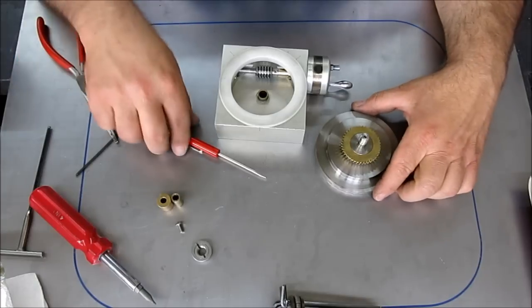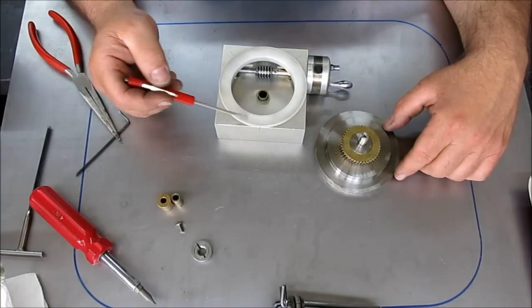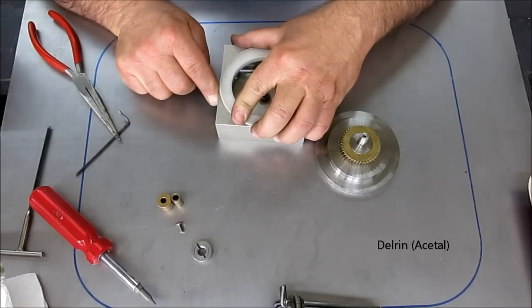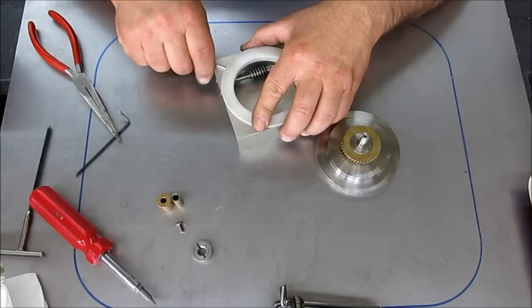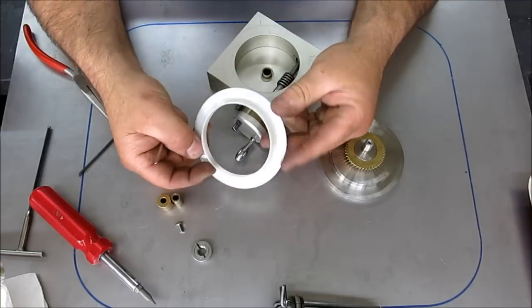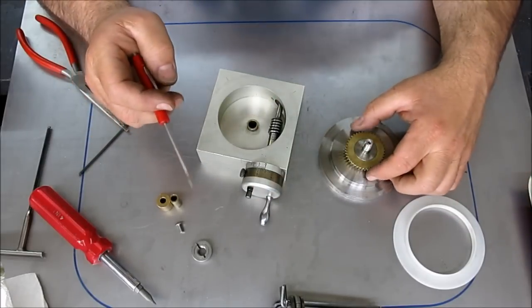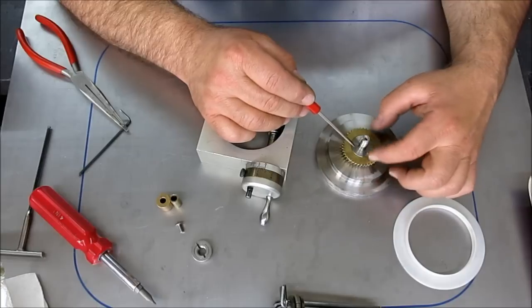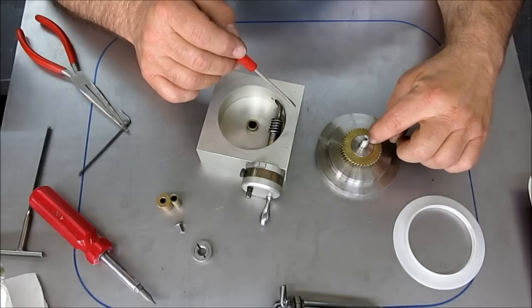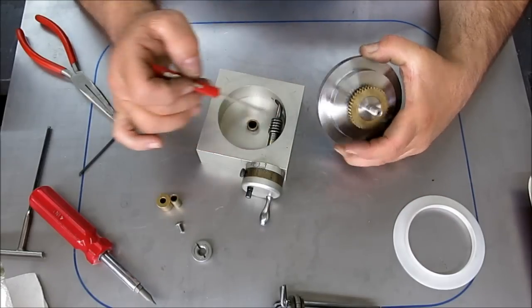We'll take a look at the inside here. There's the worm gear and there's the worm, and you can see there's a bronze bushing in the bottom there. The main table bushing is made out of Delrin here. I'll go ahead and just pop that up gently. This is a pretty good little press in there. It's just a hat-shaped bushing there — about 60 thousandths thick, something like that. Now we can see the guts of this thing. This gear is pressed on here — it was warmed up and dropped on there. This was carefully bored in soft jaws, and these were all turned concentrically. The height from this surface to here is really important to making it work right.